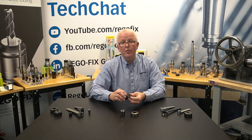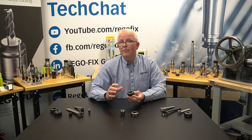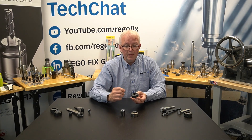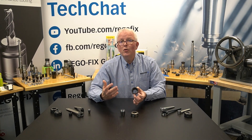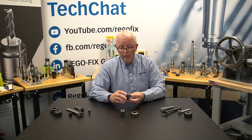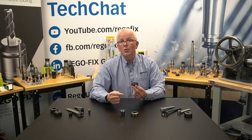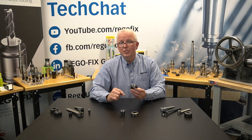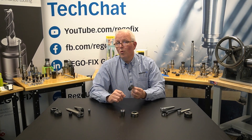That all changed when RegoFix came up with the Hi-Q nut. The Hi-Q nut is balanced by design. It's made for higher speed applications, which fit today's machining properties and applications you come across. It also is a high-performance nut. If you'll notice looking on the inside, you don't see any shiny machined surfaces — everything has a black color to it. This black surface treatment is an impregnation into the metal itself, giving you higher clamping forces. Check the link below to check out our torque videos — you can easily see the difference from a metal nut to a high-performance Hi-Q style nut.